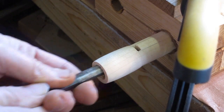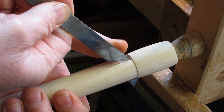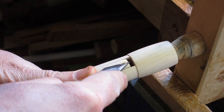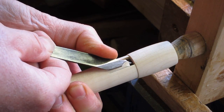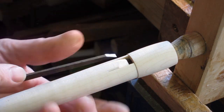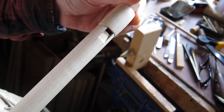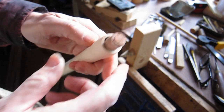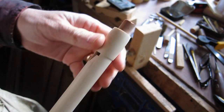You can see the window is quite rough at first, but once you've done some broaching you can cut the window correctly — it's a much cleaner rectangle now. I'm using the knives I've made, one for each side of the lip, cutting in there, and then a chisel. You basically swap between the broaching and the window cutting until you get the required size and shape, then you can test it.